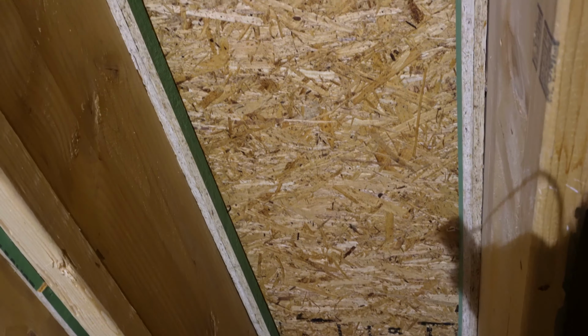1, 2, and 3 attic spaces completely insulated. And that brings us down to just 1, 2.5 bags of R38 left out of basically a half a truckload worth of it. That's pretty awesome if you ask me. I think having those attic spaces insulated will help a lot with keeping it temperate in there. And I made sure to keep that inch and a half or so air gap above the bats between the roof decking so that the ventilation from the soffit to the ridge is still continuous. And any hot or cold air or moisture can flow up underneath the roof deck into the attic and out the ridge vent.